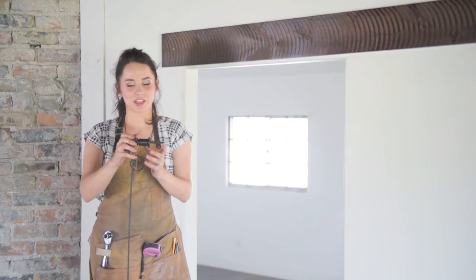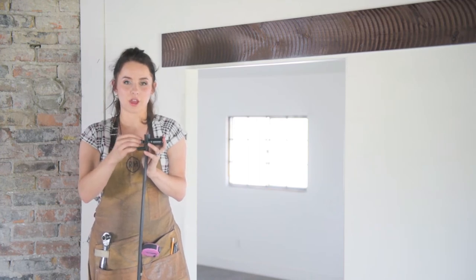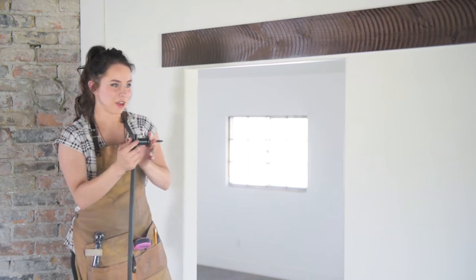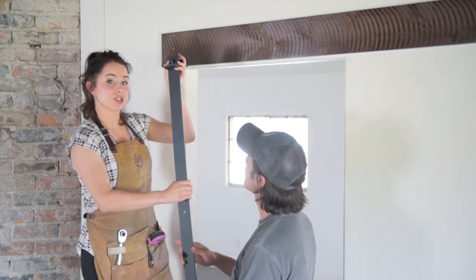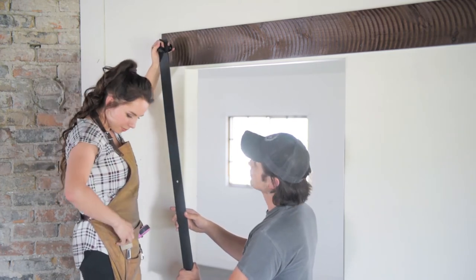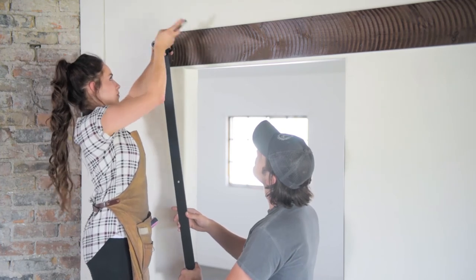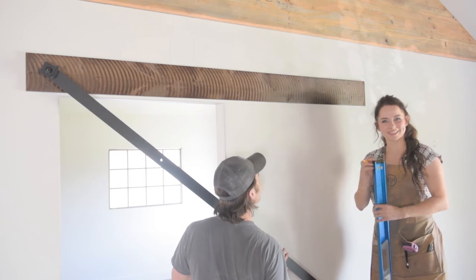As we thread our track, you will start with a spacer, track, doorstop, washer, with your lag screw going through it all. Noah, if I can grab your help, you will mount to the pilot hole that we pre-drilled, but be sure not to tighten it too tight because we will need to swing it around and mount the opposite side. Level the track and mark the remaining holes.